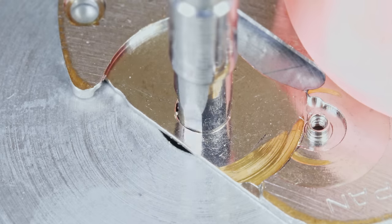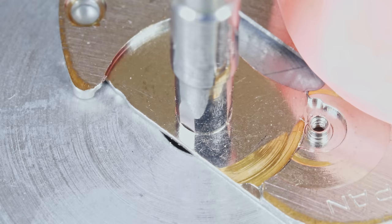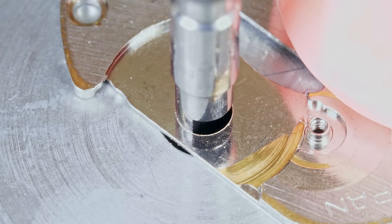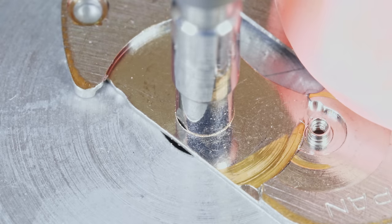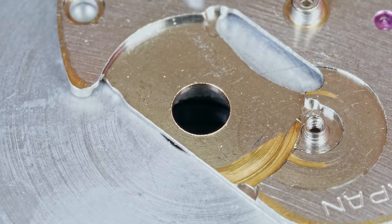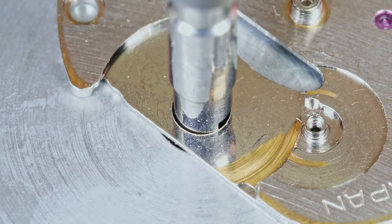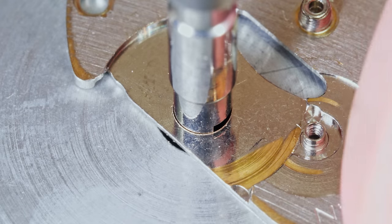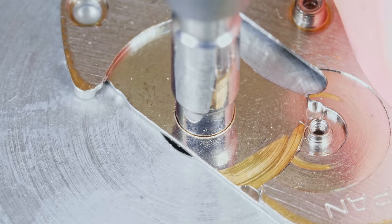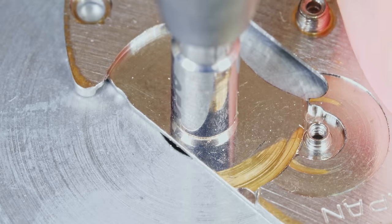The instructions for everything you need to do are in the description of the jewels when you get them on eBay. I'm applying hardly any pressure here — you don't want to force it. Take it nice and easy. Let me remove the swarf. Note that for the reaming I'm not using the stake — the bridge is directly on the jewelling table. Go nice and gentle, and you're supposed to go all the way in. See the smooth round part past the cutting part — that smooths it out after cutting. That's it, now you can remove it.